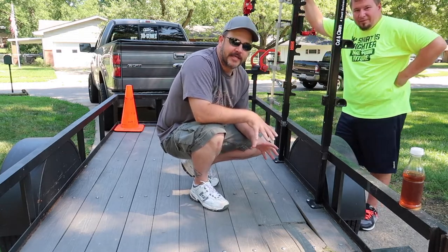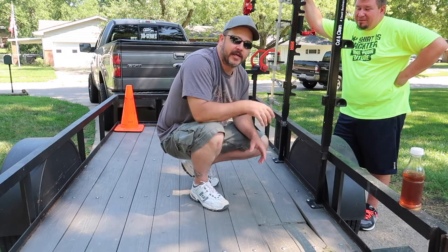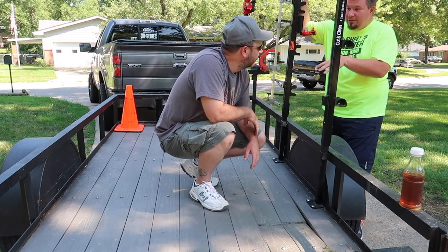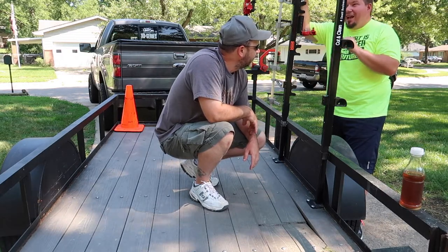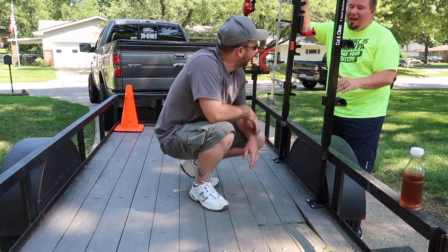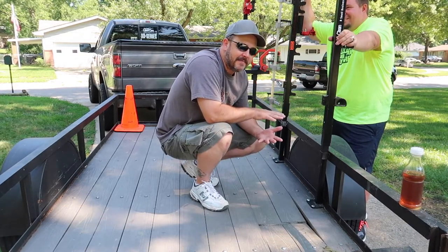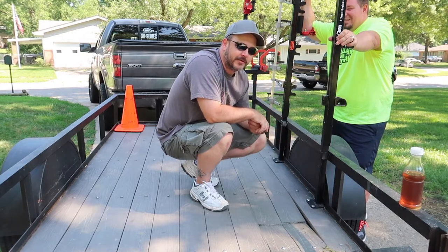So today we're going to go out and buy new decking material for this and we're going to install a proper deck. I'm going to bring you along and show you how that's done. Because a lot of people probably don't think of this — no matter what the weight rating is for something like the mower, this is rated for a thousand pounds and the mower weighs a thousand pounds, but you've got to factor in every little bump, every little jostle — that mower gets lifted a little bit and puts a lot of force back down. So there's a big difference between static weight and impact weight, and that's something you really need to factor into your materials.